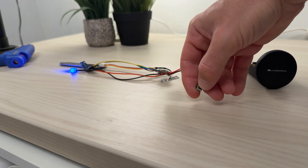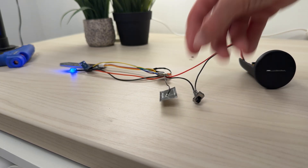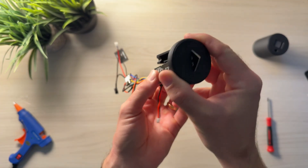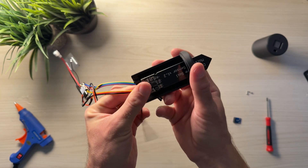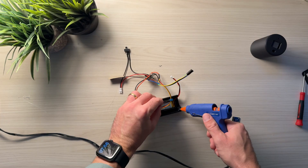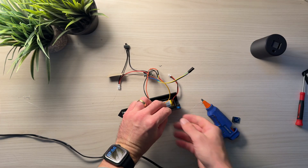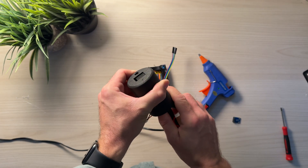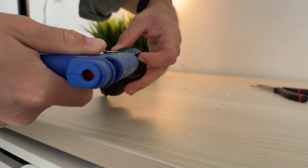Once the sensors were wired up we could test the power switch to make sure everything was powering on appropriately. Then we can move on to actually assembling all the components in this tiny little shell. First we can put in the battery, then slide the moisture sensor through the bottom slot and screw it into place so it doesn't move. We can then hot glue the LED onto the top so that when we slide over the cover it'll shine through a tidy pinhole to show whether or not the system is on.